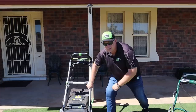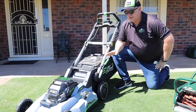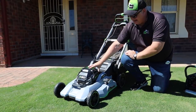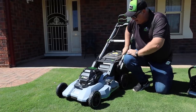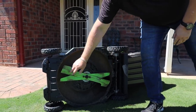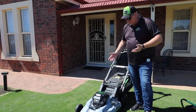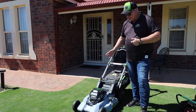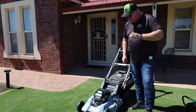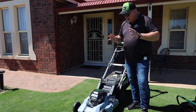The first thing we're gonna look at is the rotary mower — it's a mower that most people have. These are really great. They're very cheap and very cheap to run, with a very simple design. It'll have an engine of some sort; electric is really coming on the scene. You'll have a cutter underneath — two blades, four blades, sometimes a twin blade. They're very simple and cheap to run. You don't have to do much other than change the blades and do a little bit of engine maintenance. These will mow from about 20mm all the way up to 90mm.